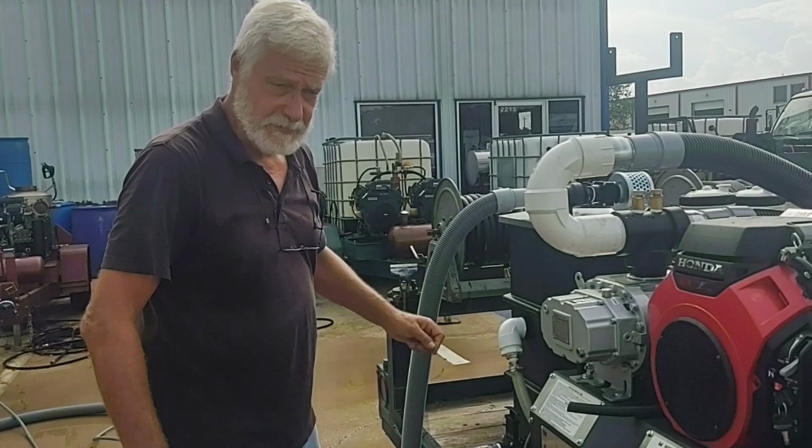Well, this is the transfer pump power switch. Basically the function is to set the internal pumps inside the receivers or the drums, where once the water reaches a certain level, it activates the sump pump, and the sump pump in turn is a 12-volt pump that forces water through the filtration system back into the tank. There is a float switch that senses when the water reaches a certain level, then it starts the submersible pump in order to do that. Once it reaches the bottom, the switch cuts off to allow more water to build up, so it'll cycle as necessary in order to dispose of the water.